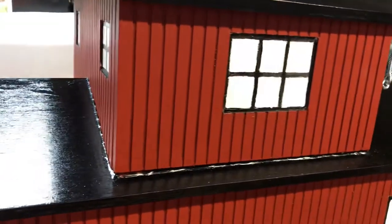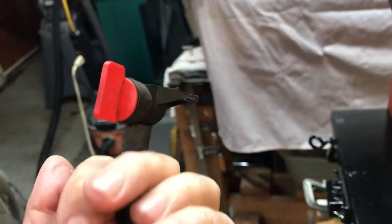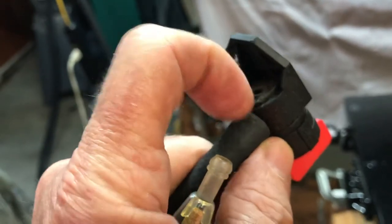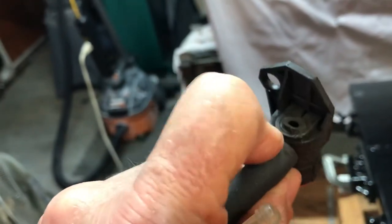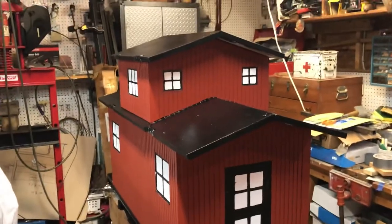I tested it every single year at the beginning of hurricane season. This past year I had to replace the fuel pump, and when I was replacing it I accidentally broke — not the fuel pump, but the fuel filter — actually accidentally broke the on/off switch. It's just a cheap plastic thing. The switch valve itself is not broken, but the rubber outlet barb broke off flush. I do need to order a new one of those, but I replaced it with a brass one I had from an old pickup truck that had a manual fuel line cutoff.